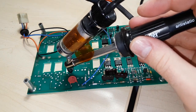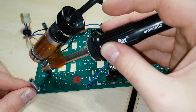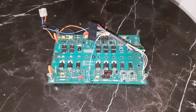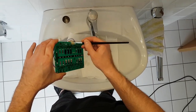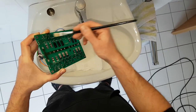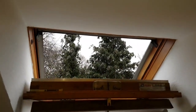That's the most difficult part done. Now I need to prepare the output module by adding a couple of transistors and miscellaneous parts. For cleaning flux residue off circuit boards, I use a coarse brush with enough acetone to make it drip onto a paper towel, then dab it dry — otherwise the acetone evaporates and leaves the dissolved flux behind again. Acetone apparently isn't as bad as people used to think, but the smell is kind of horrible.